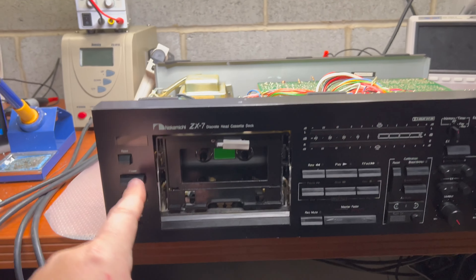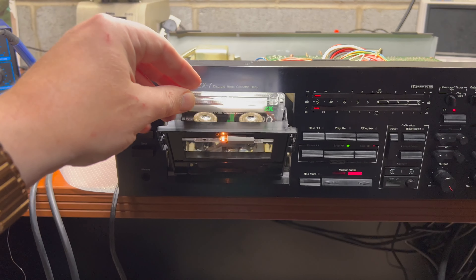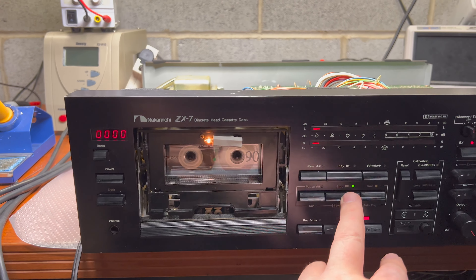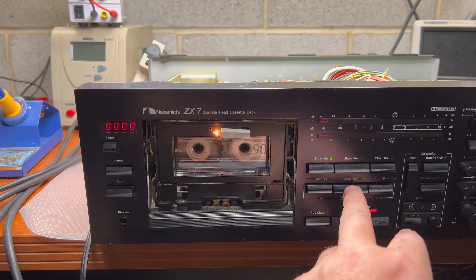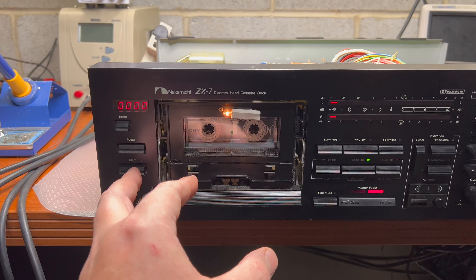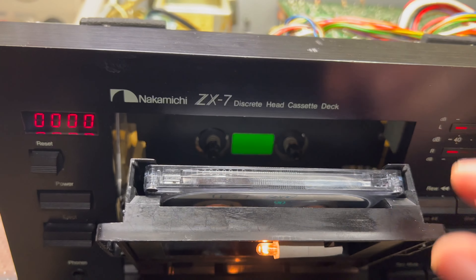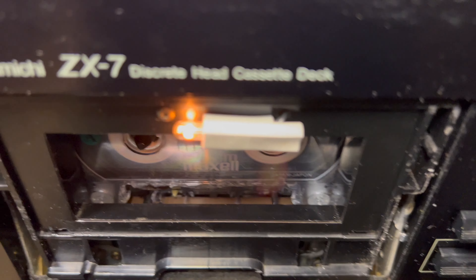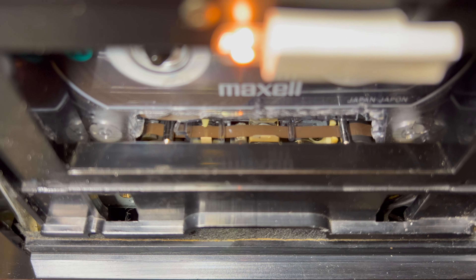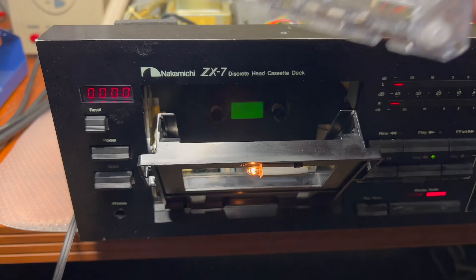Okay, it's time — let's power it up. The indicator lights work, the counter works, play and forward and rewind all work. With the new idler it works — quick and easy playback. The tape is empty, so let's check the tape path and try to straighten up the record head, which was way off. Now let's check the tape path — it looks to be straight. Good.